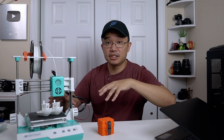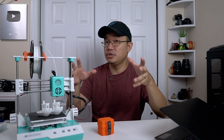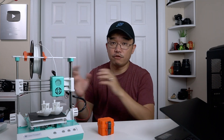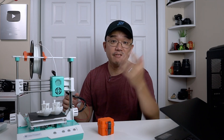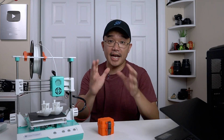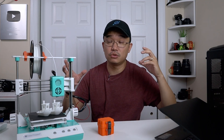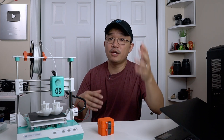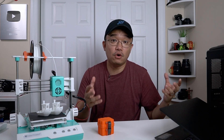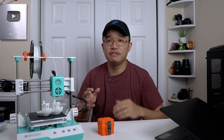That's it for calibrating this 3D printer. I can leave all the settings I found in the description below, but you'll need to fine-tune the E-step settings since every printer may be off by a little — mine extruded 94 instead of 100, yours might differ. The calibration method works for all 3D printers, so if your printer feels loose or has slack, use these steps to retune it. If you have questions, drop them in the comments below. If you're new, consider subscribing and hitting the bell notification icon. And as I always say: nerd cave, hack till it hurts.